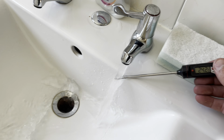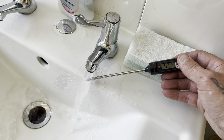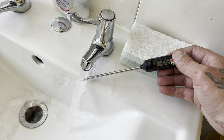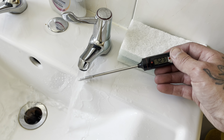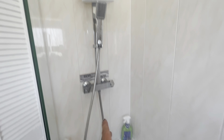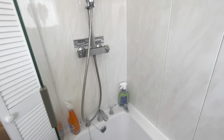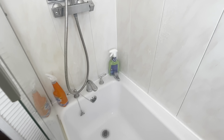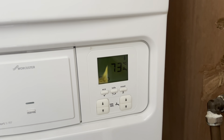See what she does. The boiler's modulated down — it's not knocked off like it's been before. It's ramping back up again now. It seems to have cured the fault. So the main issue was they noticed it on the shower, keep knocking off. Now that could have been down to the cartridge in the shower itself, but I'm presuming it was the plate. The shower's been running now about five minutes and it seems to have stabilised on 73 degrees. That's boiler temperature, obviously not shower water temperature — it's set to 60 on that. Much better.